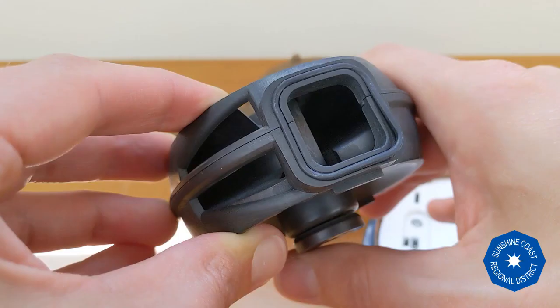This size of meter requires 320 milliliters to complete one spin, providing a precise volume of water recorded with each spin. Nutating disc meters maintain high accuracy at low flows and sustain this accuracy over the long term.